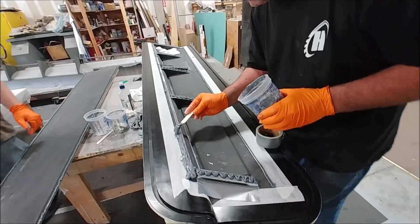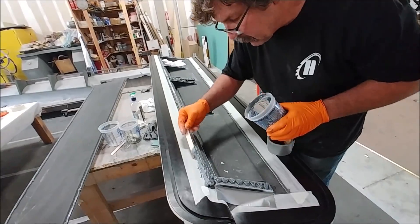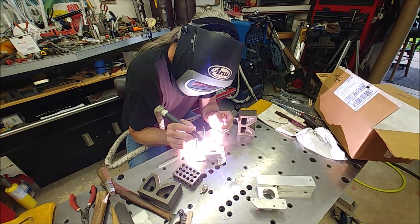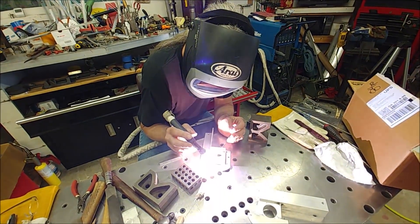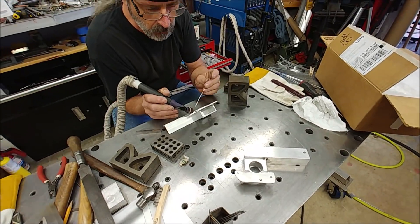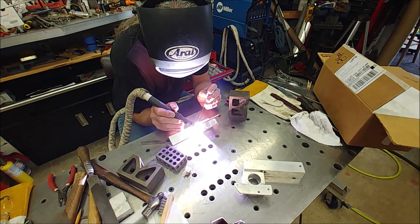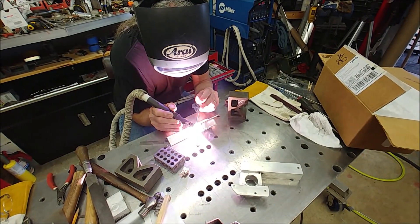Here's Jeff setting up and applying Hysol to close out the first aileron — the right-hand side one — putting Hysol on all the flange areas around the edge and on the ribs, ready to bond it up. I also ran up to Britt quickly so he could weld up the pieces for the little quadrants for the doors that actuate the pin locks and hook locks. Hopefully the design works nicely and all the locks get actuated at the same time.